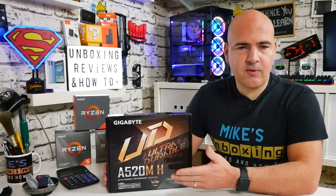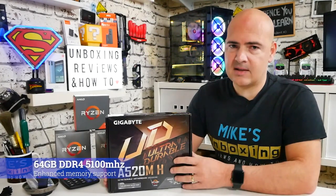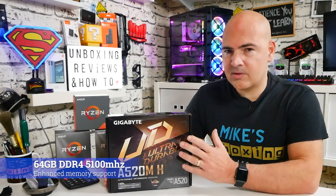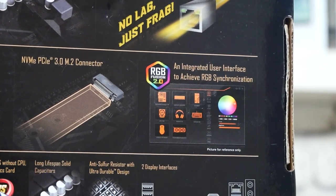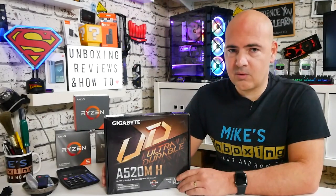This version upgraded features include double the memory capacity — up to 64GB of RAM versus the previous 32GB. It also adds digital RGB and standard 12-volt RGB, which was missing on pretty much all A320 boards. Let's take a look at the packaging, have a quick tour of the motherboard, then fire up the BIOS, and I'll come back with my final thoughts.